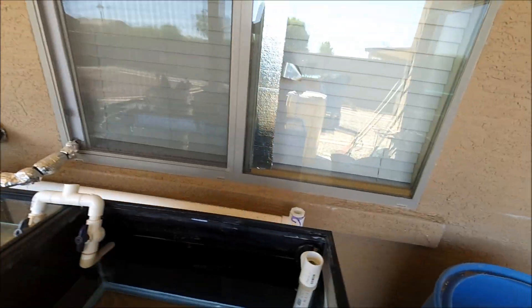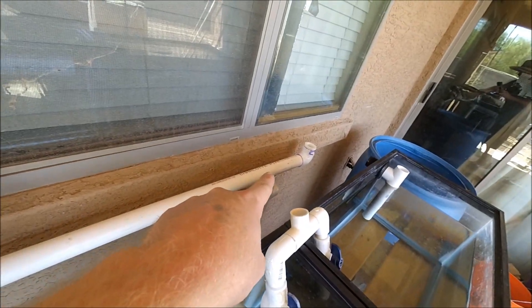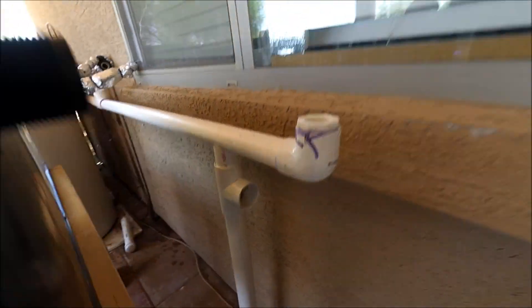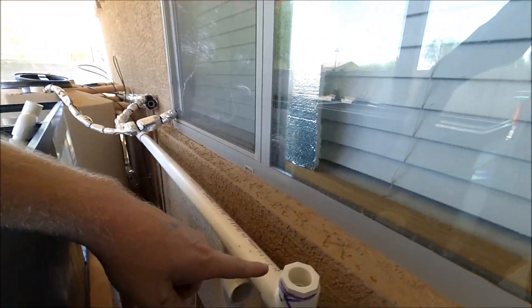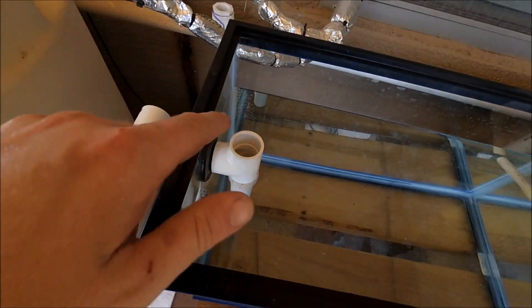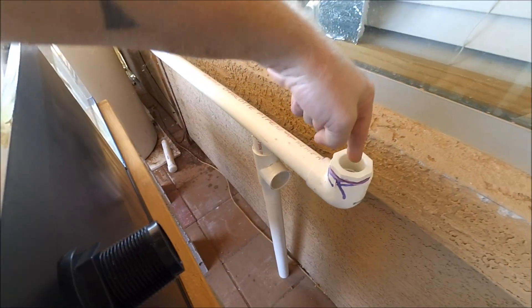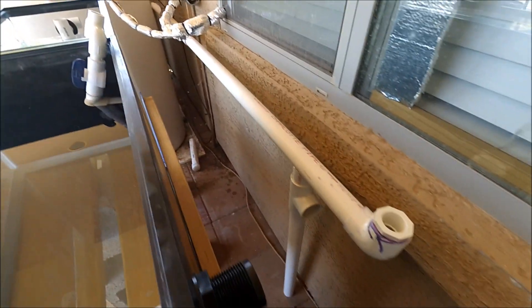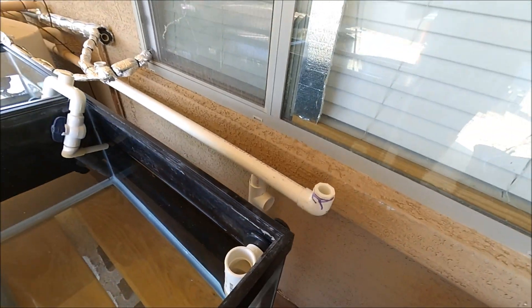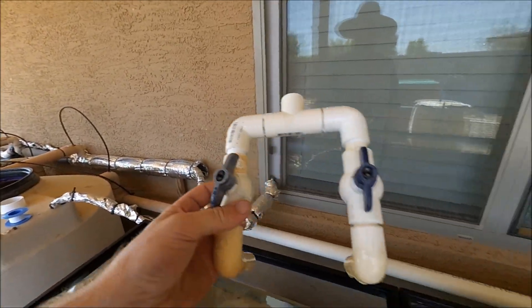Okay we're back. I've got the drain installed and tied into the main system. I have it elevated on this end just a tiny bit, and I cut this one-and-a-half inch piece of PVC right here just to act as a leg, so that this end is higher than that end and water is running down. Now all I have to do is finish the drains going from the fish tanks into the main drain here, which is easy — it'll just come straight out here and down into that. I'm not going to glue these — I'm just going to use pipe thread tape. That way down the road if I want to change this all up, move it, or expand it, I'm not wasting pieces by gluing them together. This whole manifold is all pipe thread tape pressed together.